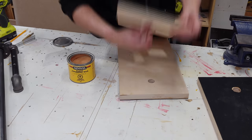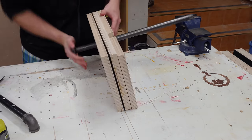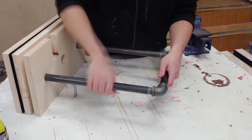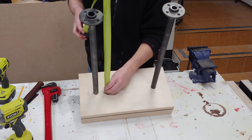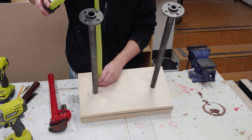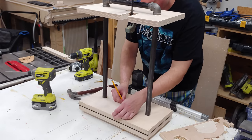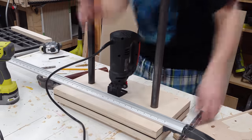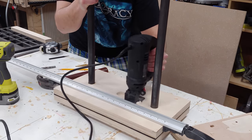After that I applied some paste wax to all six of the holes and began a dry assembly of the vise. You really want to get both of these flanges sitting on the exact same plane, so in order to get these equal I simply slid all the pieces to the bottom and measured up to the top of the flange — that way I could balance things out by simply giving a quarter turn here or there on either side. Next on the backside of the fixed jaw I can mark out my center and using some Forstner bits drill out some clearance for the back of the linear actuator. This is kind of a dome shape so I go ahead with a bigger bit and then a smaller bit, then using my trim router with a half inch bullnose bit to create a recess for a 3/8 inch bolt to fit, which is going to slide through the back of the linear actuator and hold it in place.